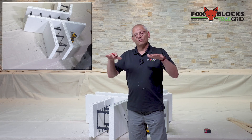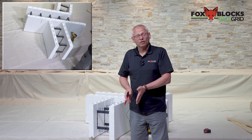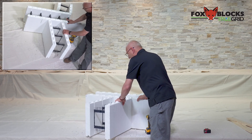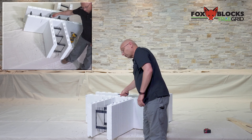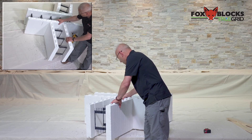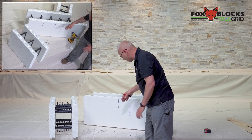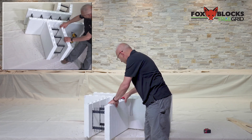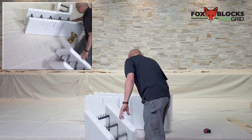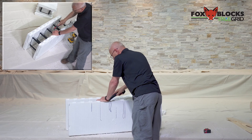The way to do that is just stick pieces of rebar out, put some 90s in, pour concrete, then after the pour cut the foam out, butt your demising wall up against it, and pour concrete in this one. It works great. Here I have a T-wall — I'm going to bring an eight-inch against an eight-inch. Find out exactly where you need to be and then cut that out. Ideally you don't cut the tie in this wall if they're both hollow and you're doing this all in one section — you'd cut to the inside.